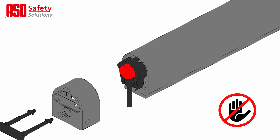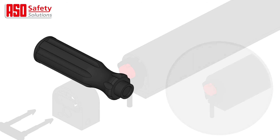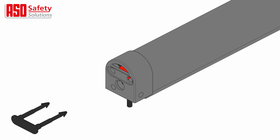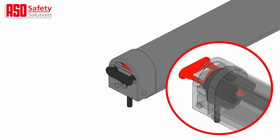Now press with force on the plug using a thumb to drive the plug into place. Remove the pressure and then press the plug again to ensure the correct fit. Optionally, an assembly aid available from ASO can be used. Place the end cap neatly over the plug and lock cap, then fasten it by pushing the fixation clip firmly into the holes marked on the end cap until it clicks into place.